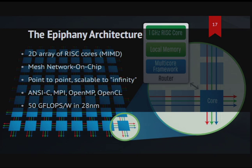And all these cores are connected with a 2D mesh and a very fast network on chip. With all the networks and all the clocking, there's not a single global interconnect in the whole chip. So, potentially, this architecture could scale to infinity, since it's just putting down a tile. And that's worked very well for us. We've done 4 chips. The last one we did was in 28 nanometer and worked out of the box. We did the whole chip with 3 engineers in 12 weeks. And so the idea of modular, tile-based design, it's magic.